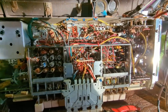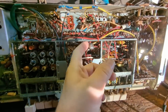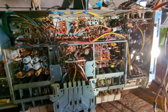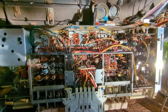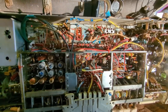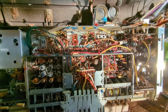I'm going to start replacing capacitors. What I tend to do is snip one end of the old capacitor off — especially if you can't read the value, you might need to twist it around first — then attach one end of the new capacitor, then snip the other side, and repeat. I do that because I don't want to lose my place. It's very easy to suddenly not pay attention and find yourself without a reference. I've had a lot of people say I curse too much on my videos, and I'm trying to do better.